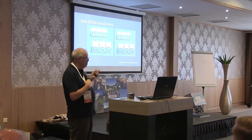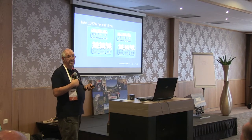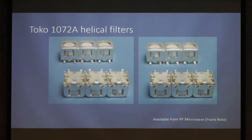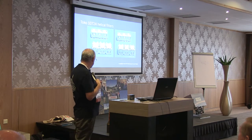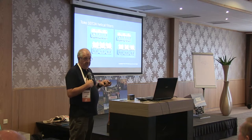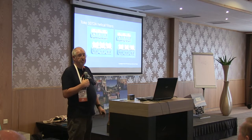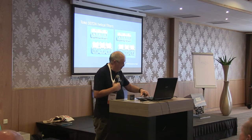I found that Franco, although these are no longer made, unless you want to buy a reel of 10,000, and then there's several people who make them for you, he sells these at quite low cost. And this particular one is a 450 megahertz filter, but it tunes quite happily with acceptable input and output return loss all the way down to 432, and they're relatively cheap. So I used two of those, and they had thousands in stock. When they're gone, they're gone.